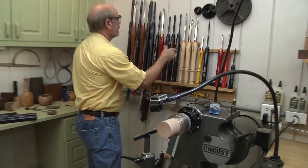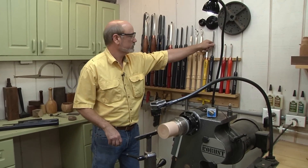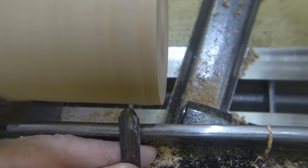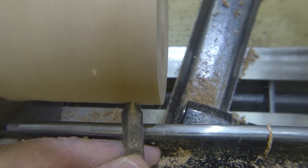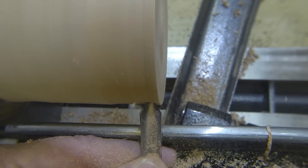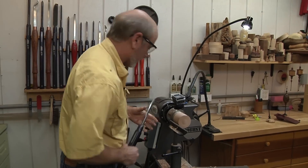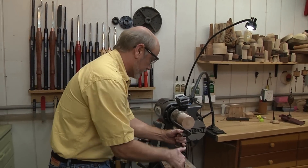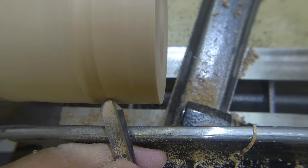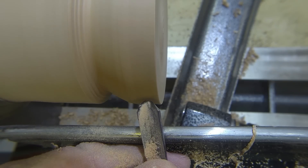Let's switch tools. I'm going to go with a spindle gouge with a regular grind — just a little rounded grind, not too pointy. I'll come in here almost like a roughing cut, just come across and clean up the wood. Once I get that done, I'll be really close to the diameter I need. We can check that occasionally — bring it up and look at it. Yeah, we're pretty much right on. I want to go ahead and shape this just a little bit. I'm going to start turning in this way and just making one big old bead. I love how maple turns so easily and so beautifully — it is a joy to use this wood.